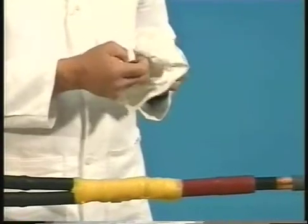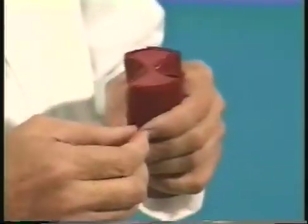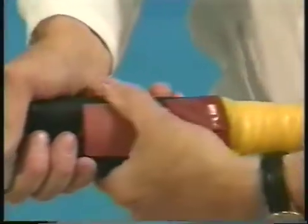To install the red insulating crotch profile, or ICP, remove the backing paper from the ICP and position it between the run and tap cable with the sealant side in. A thin layer of silicon grease may be used to make this easier, but be careful not to over apply. Push the ICP up against the installed SRM, then make sure your tap cable is laying parallel to the run cable and is up flat against the ICP.